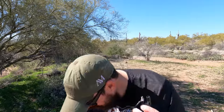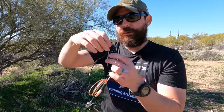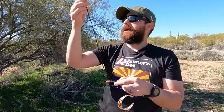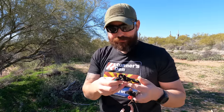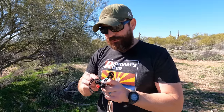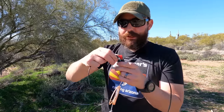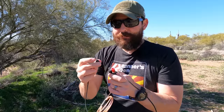I'm using the cheap Chinese Cobra head. The reason for it is I bought a really nice one from Pomona Electronics, but theirs is captive and I can't remove the thread caps, so I can't put the ring terminals over it. This will be connected up to some cordage from this small Palo Verde — this will be the radiating element. I've created two more of exactly the same lengths for the radials. I'm only using two; the military handbook actually shows three, so you make a pyramid.